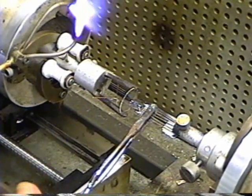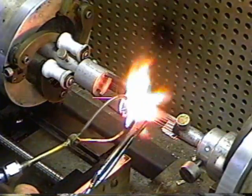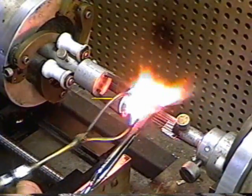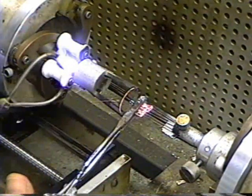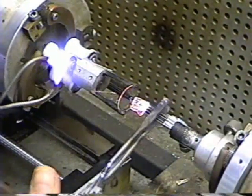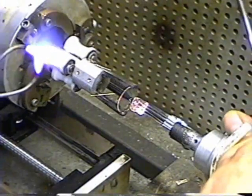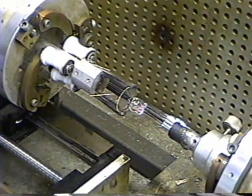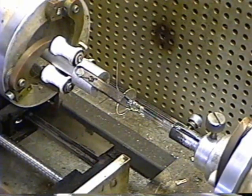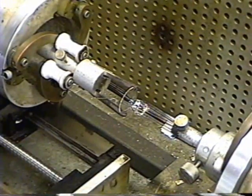Now we haven't done the seal yet. I'm going to keep the masher on the wires so I don't melt them, and heat the glass up in the seal area. Okay, that's the seal — I just did a very strong mash on the seal. Now I'm going to catch the lead wires and clean it up a little bit. You can imagine how difficult this would be without the lathe to hold everything in position. That looks very good. Let that cool a little bit. I want to take a look at it with the magnifying glass to make sure we got a good seal. That's perfect — that takes care of our seal.